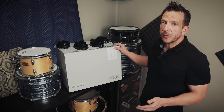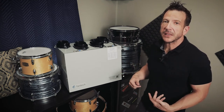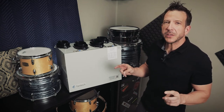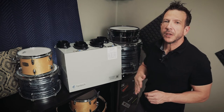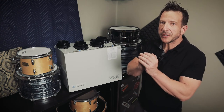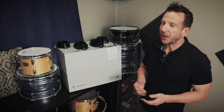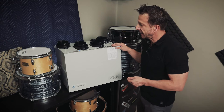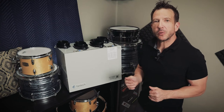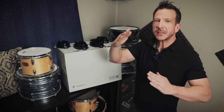Now, you could possibly set up a system where you just turn on a fan and dump air from outside into your space and then relieve that air either through another fan or possibly what we call a barometric damper or a non-return damper. And that's like a pressure relief. If you imagine you've sealed this space airtight, if you're blowing air into a balloon, it's got to have somewhere to go or it will stop filling up. But what this does is it accomplishes all of that, bringing air into the space and relieving the air out. If you think about those two streams, I'm bringing air from outside into my space, and I'm taking air from inside my space and bringing it out.